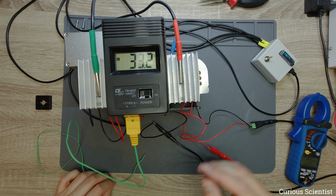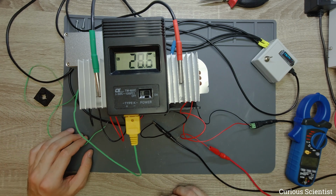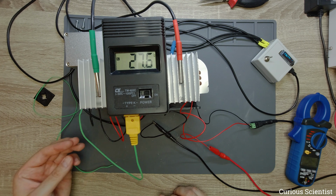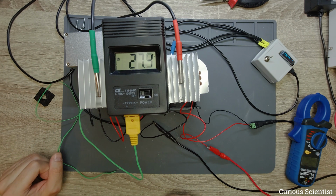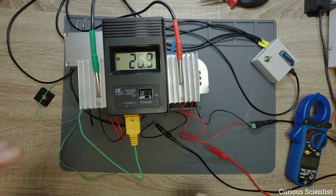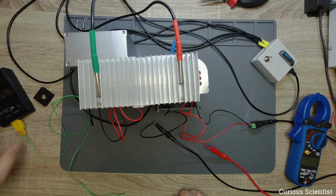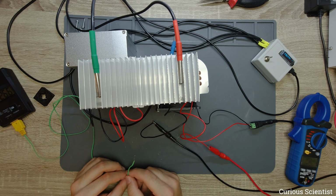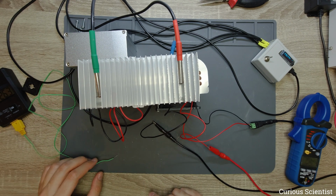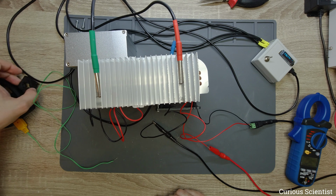So the hot side is, let's say, somewhere between 45, 48, maybe 50 degrees, but that's very good, because if we use DT equals 50, then we end up around 0 degrees Celsius on the cold side. So I think this will be a more powerful cooler than the previous one, for obvious reasons, but still this will be very nice to see.